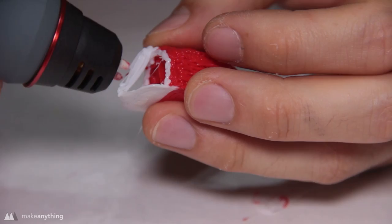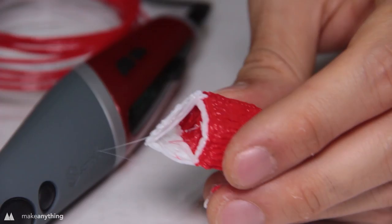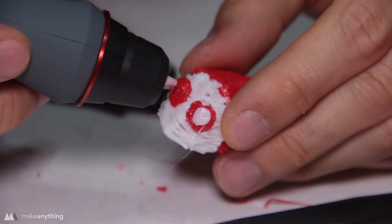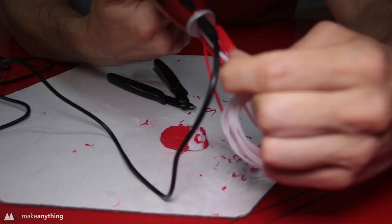I switch to white and do basically the same thing for the front. At this point things warmed up enough that even when I was using just the white nozzle, some red was still leaking out — at the minimum PLA temperature of around 180 degrees Celsius. That was kind of annoying, but at least I could go back and forth between red and white without ever swapping filament. I add white details on top of the red eyes and create a little mouth section, then go along to put dots on the shell — but the red filament keeps oozing out.